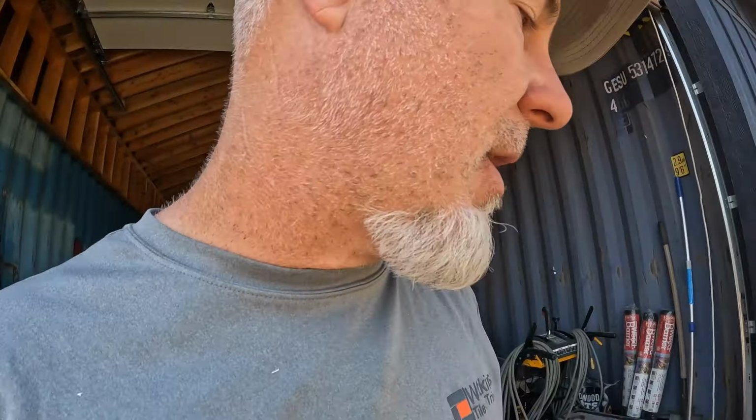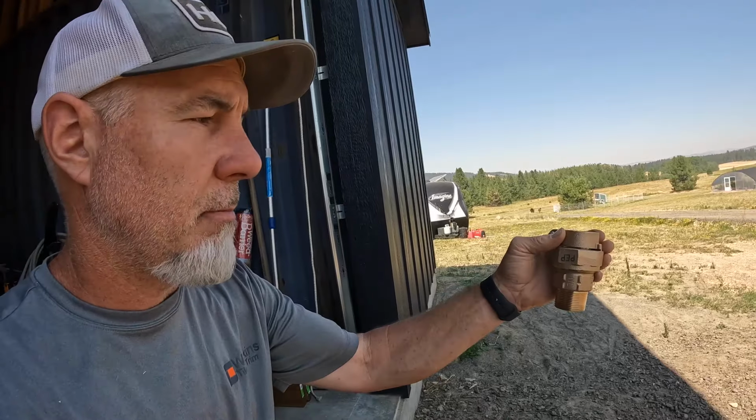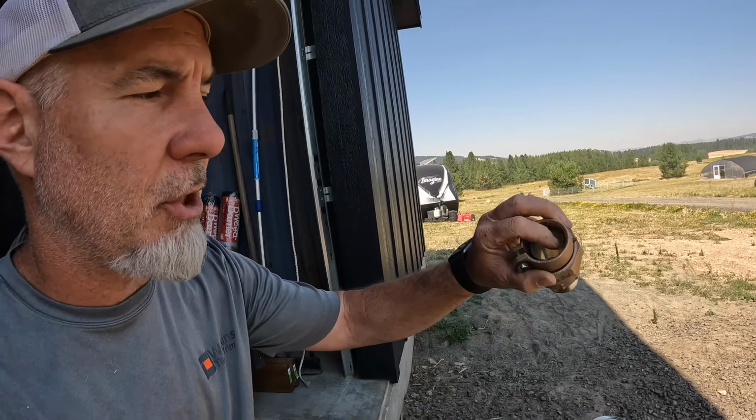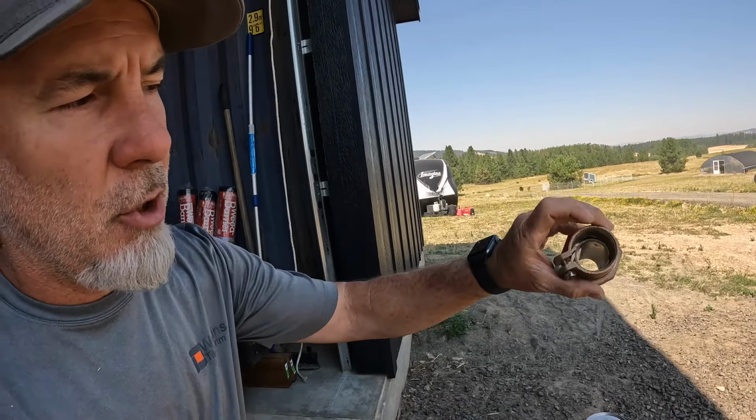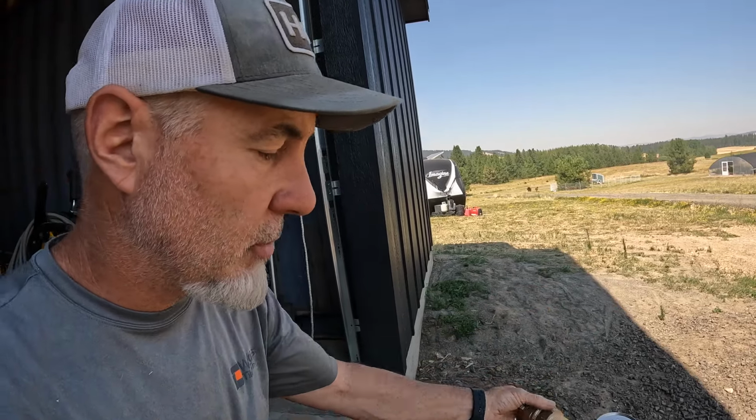And at that valve, we are going to connect 1¼-inch poly plastic line for running, for like a well that you would use for a well. And to do that, we have a couple of different parts. This is a brass fitting for that 1¼-inch poly. The hose goes in there, and then it goes to a reducer that will step it up to 2 inches.